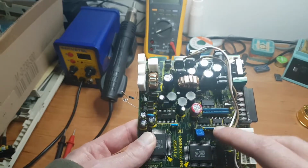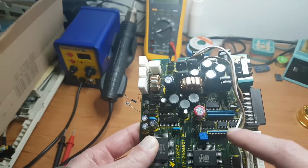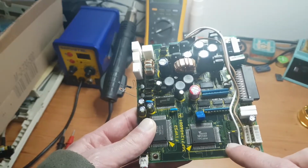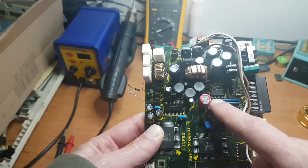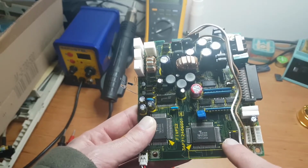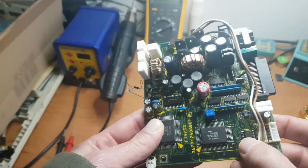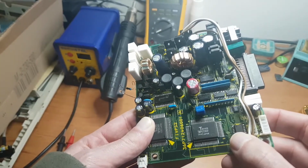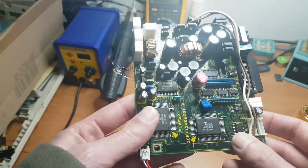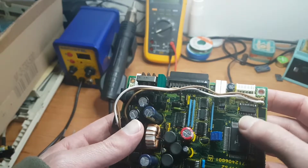improve my schematic. And so I tested all these. All of them tested reasonably well, except for this one, which was originally over here. It has one bad MOSFET in there. It doesn't really ground the signal, and it should do that. That's the only thing this thing does.